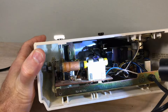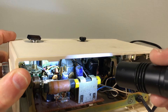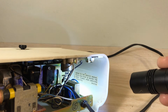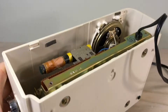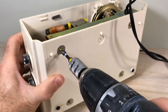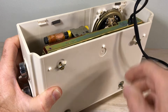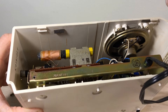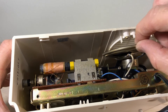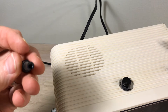Our first look here — it's pretty dusty in there. No major burnouts, nothing obvious, no shorts that I can see. No live bugs, which is always a blessing. To get this out, the first thing we want to do is get this speaker unhooked. You'll unscrew those two screws there, and then there are four screws on the bottom. I'd recommend getting the knobs off first. Just four screws and they have washers — the older clocks had a lot of washers and lock washers that later they didn't bother with. The speaker just pulls forward a little bit; there's a little hook in the back. Comes right off — lay that there carefully before you get ready to pull that whole assembly out.